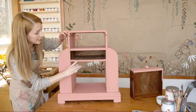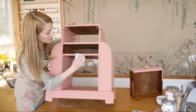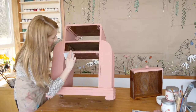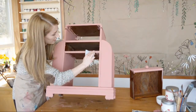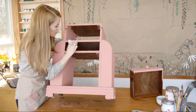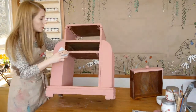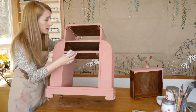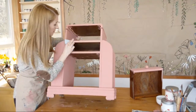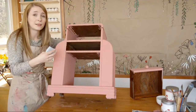There is a lot of really nice detail — some kind of trim that might not be visible in the camera but it's really nice. I'm just going to pass over really lightly to expose some of the lines. I did about two and a half coats and a really thin third coat, so I do have to apply quite a bit of pressure in some areas that are very covered. The rule of thumb for distressing is to always work on the outside and then go in — it's also really good for blending paint to create depth.